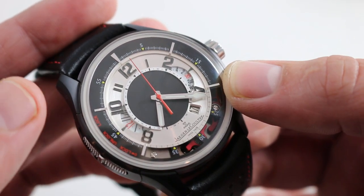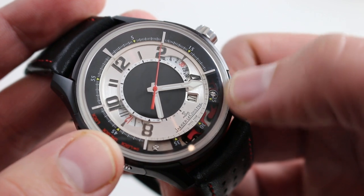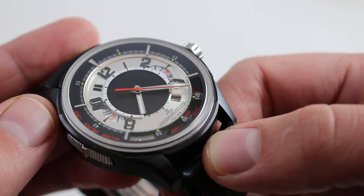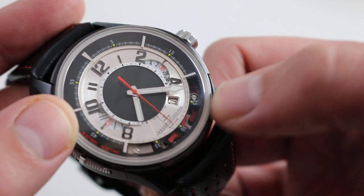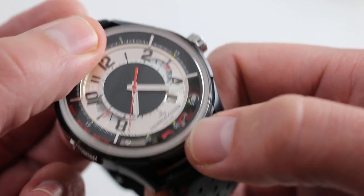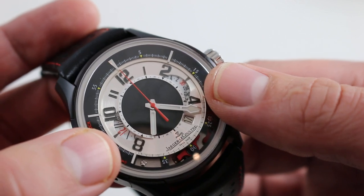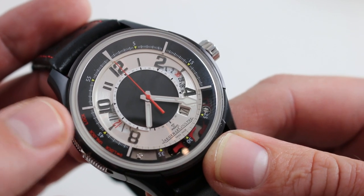The dial itself features a template based on Aston Martin vintage tachometers and speedometers, which is why 270 degrees of the dial is calibrated and the lower 90 degrees is left largely uncalibrated. You can see there's depth — just like the concentric circles and scales of a dashboard instrument — with wonderful texturing and different planes of focus. The dial really changes the eye level, as well as opening up a little bit of the mechanism. You can see the ball-bearing pivoting chronograph hammers at 6 o'clock. To read the chronograph: chronograph seconds at center, an hours disc at 9 o'clock, chronograph minutes at 3 — fully luminescent. The discs glow like UFOs at night, with calypso-style hands inspired by a small run of Italian-market Polaris 68s from the golden era of the dive watch.